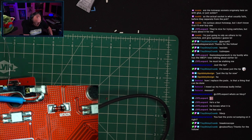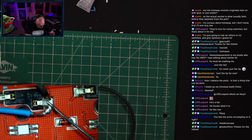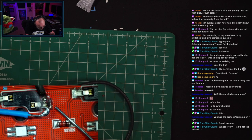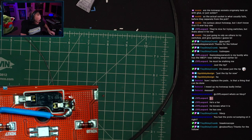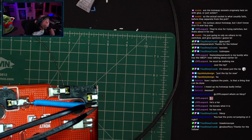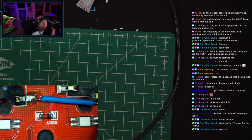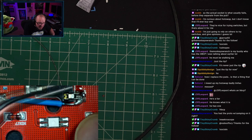Tin the pad underneath, which is gonna be kind of hard to see from here, but I'll try my best. Not melt the plastic. Okay, perfect. We're gonna place it in place. So we know that there's some tin there. We're gonna press it in where it needs to go. It'll be a lot harder now to fit into place. Pressing it down, kind of pressing it into place.